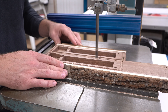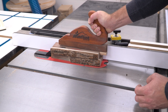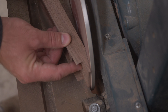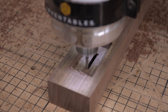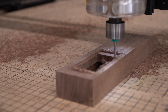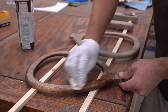I carefully separated the two halves at the bandsaw, then jointed that edge. Then, with the parts pinned together, I cut off the rough edge on the table saw. I cut the handle to length at the miter saw, then used my bandsaw and a disc sander to add an angle to make the transition from head to handle a little less chunky. I needed to be able to replace the batteries in this thing, so I cut a hole through the back, then added an oversized recess that a cap could fit into. I added a roundover to all the corners, then spent a ton of time hand sanding to make everything perfect before adding finish to the outside.